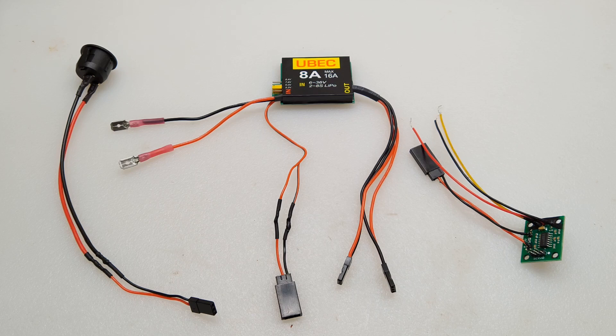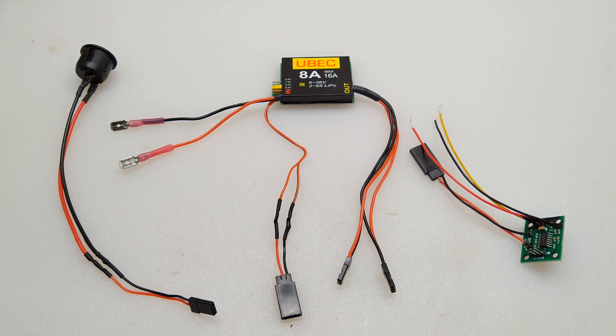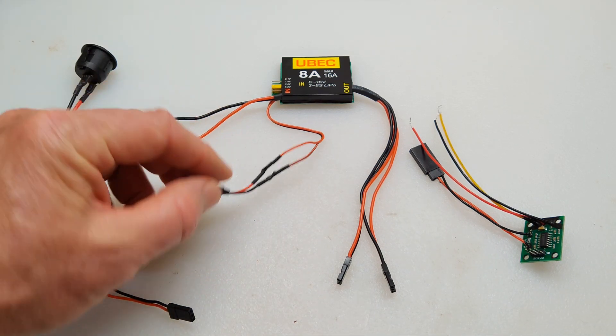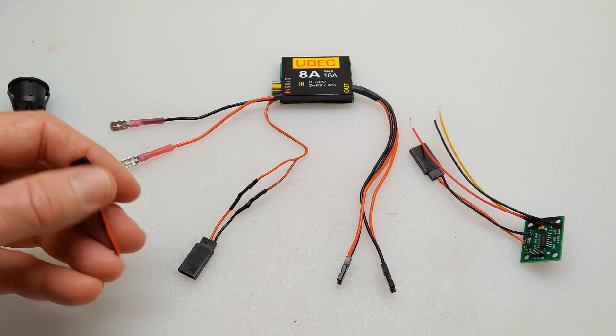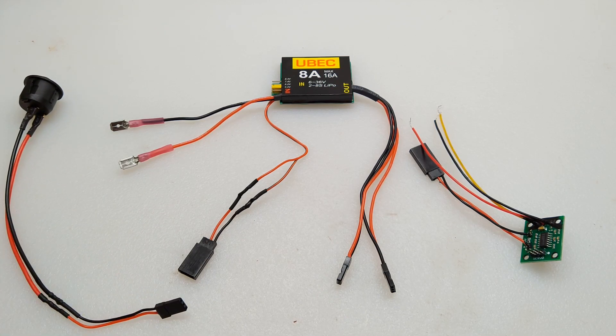I wanted to give a better detailed view of the modifications I made to the UBEC before I put it in the box, because then it's going to be hard to tell what I've done. For the power input to the unit, I put spade connectors on, and I'll have the female spade connectors for the power. I cut off the on-off switch, then used a three-pin female connector and just used the positive and negative wiring. I took a new on-off switch and did the same thing on the male connector — I just spliced in the positive and negative, and that way this will be a quick disconnect when I want to remove it.